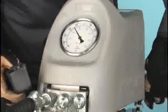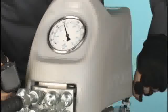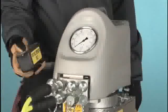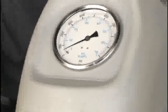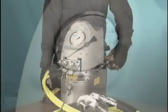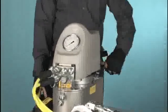Press and hold the remote button. While doing so, gradually screw in the pressure regulator knob until the gauge reads 4,000 PSI. If you pass the target, release the button, unscrew the regulator knob, and try again to stop at 4,000. When ready, re-tighten the locking nut and check the pressure one more time to ensure it did not change.